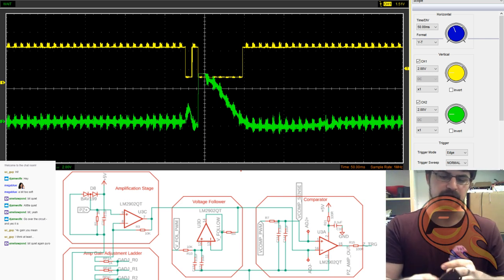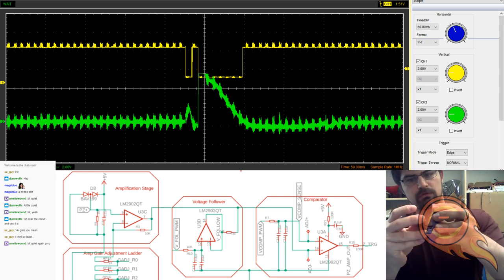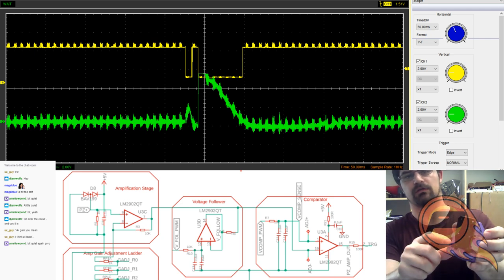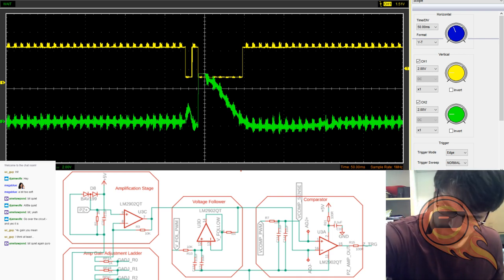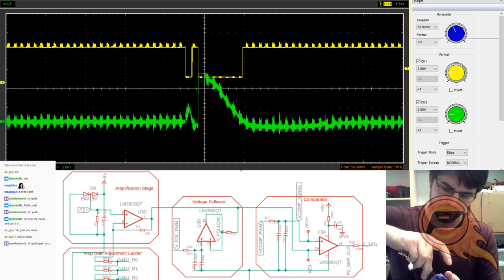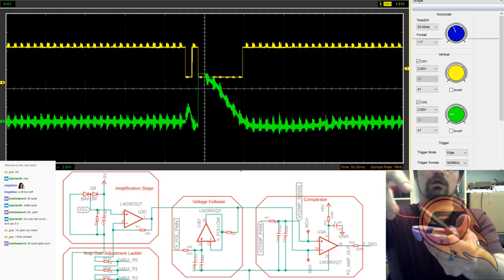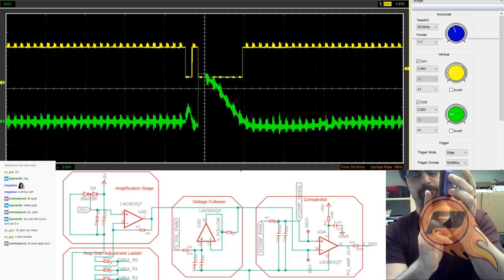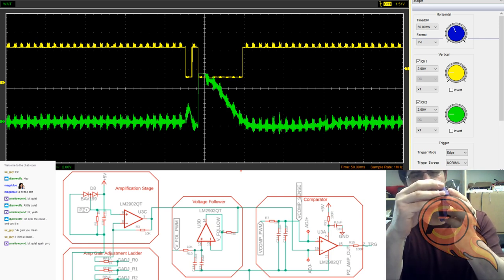Now this is what you attach to your extruder, and that gets attached like so. You have a little fulcrum there, screw goes through it with a little nut on the other side. You have a piezo disc that would sit in the middle under here, like so. And then when the nozzle touches the bed, this will move up in that way, and then poke the piezo disc.